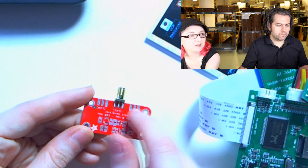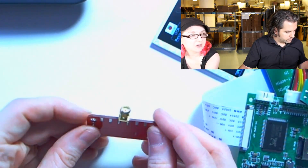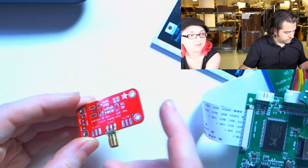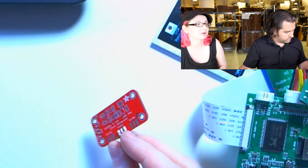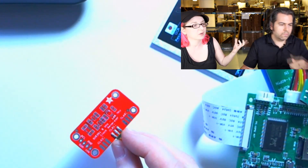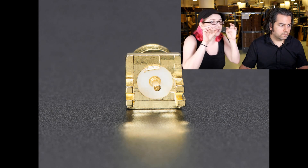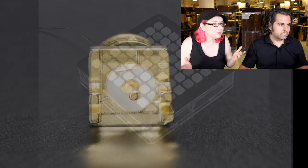So it's an Edge Launch SMA connector, and you basically have these three pads. The connector launches out the edge of the PCB and hugs the edge. You have two connections for ground on each side and then a signal line. We had the ones for standard thickness PCBs, and now we have ones for half-thickness PCBs. So if you're doing RF work and you've decided to control your impedance by having the PCB be half thickness, for closer traces, you want this thinner one. You can see the slot between the two legs is only 0.8 millimeters, really good for half-thickness or even thinner PCBs.